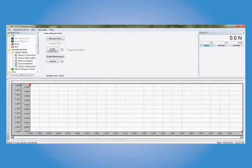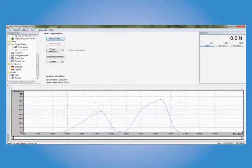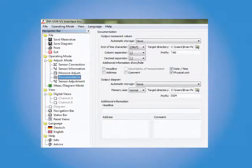From the measurement screen, there are tare, min-max monitoring, as well as shunt cal features. Once measurements are being taken, the graph goes to real-time mode and will automatically rescale depending on signal magnitude to ensure maximum display resolution. Test data is saved automatically during measurement mode and can be exported as comma-delimited text files if further analysis is required. Data plot captures can also be saved as well.